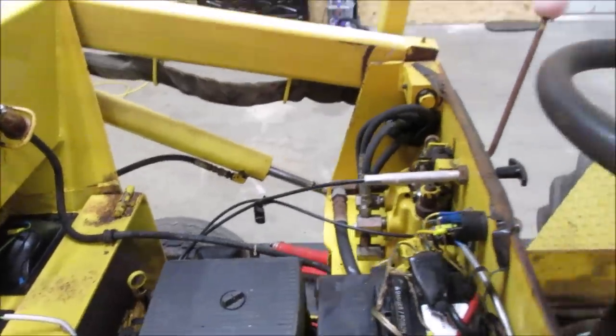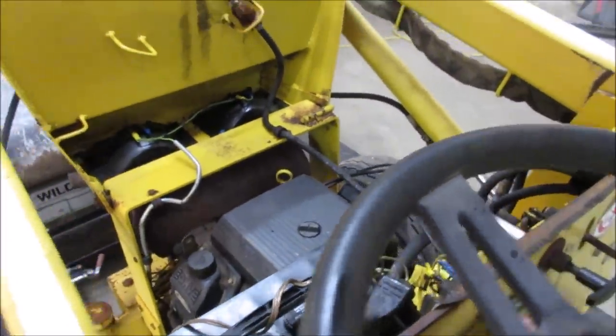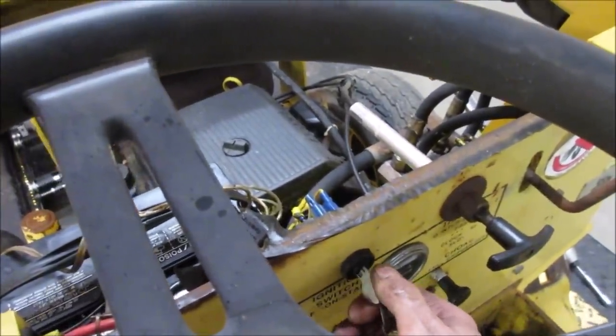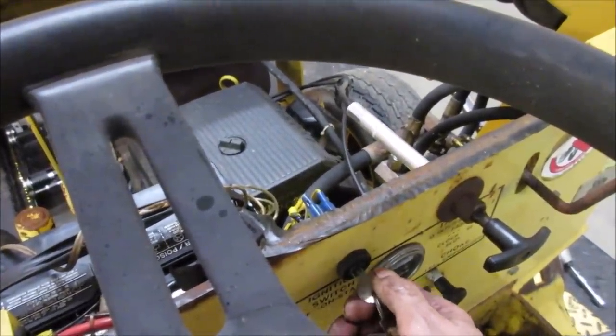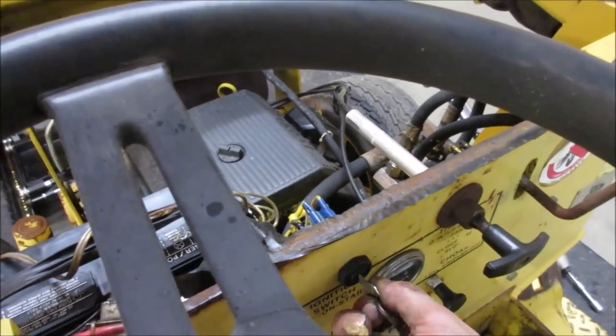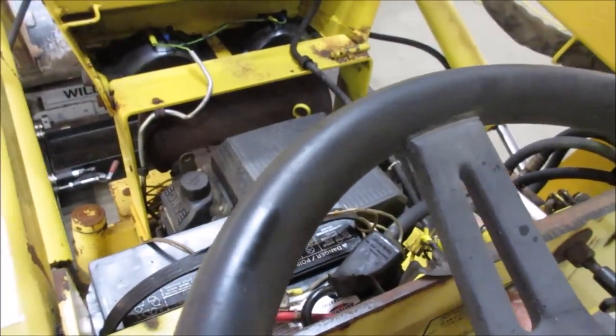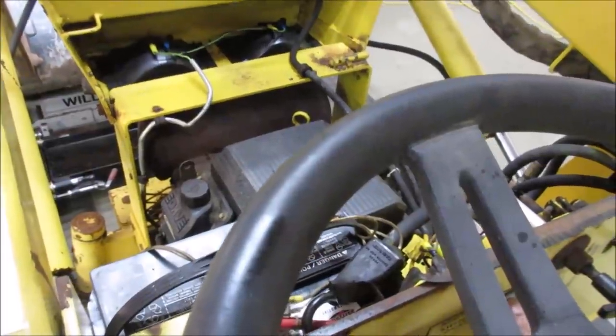Once in a while, the starter doesn't catch too. Here, the solenoid kicked out, but it didn't crank. Like that right there. That's on the starter. I'll keep an eye on that. Again, that's what happens. Stuff sits. Yeah, I missed altogether.